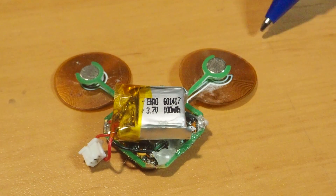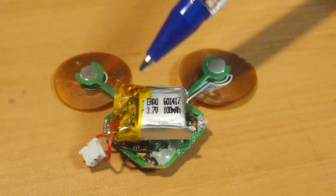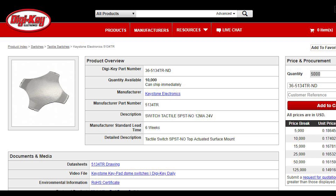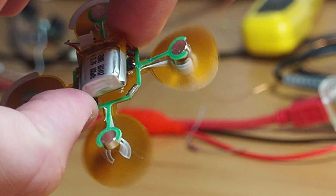From the results of this test I can say that the robot can move this way and this way and also rotate around. I think I can also make the robot move forward by powering both legs at the same time, but I can only do this with a higher current rated battery. For now it can also go forward by making a zig-zag. I was also thinking of using one of these metallic dome switches for the next prototype to act as the pivot and maybe even act as the power switch of the robot. The downside of using a two-legged robot is that it needs to waste energy to turn around, but it works, and no matter what battery I choose it's always going to be one gram lighter than the four-legged configuration, so I can also use a battery with a higher capacity.